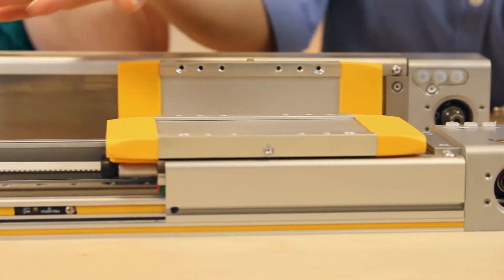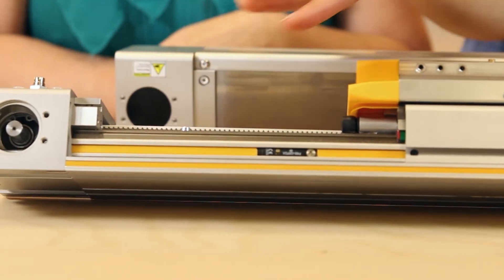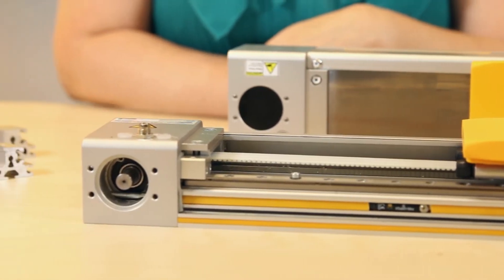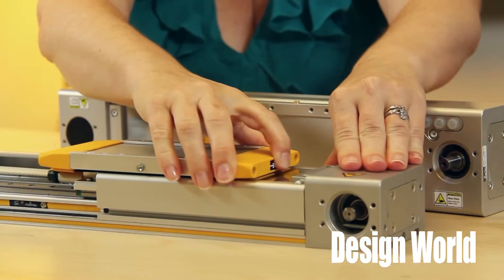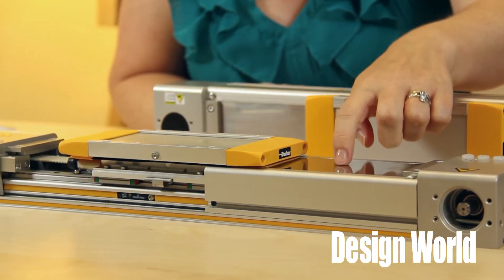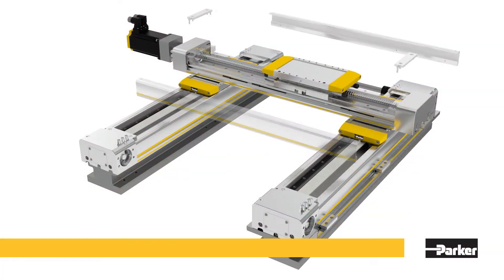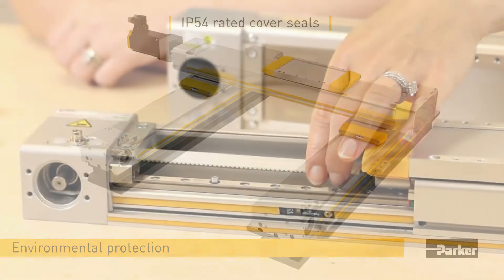Consider this HMR. It's a dual-square rail-guided actuator with solid covers that completely wrap the outside of the chassis, with Parker's best-in-class seal strip technology to protect internal components from contamination. But this HMR actuator comes in a multitude of other configurable options. For example, the HMR can be configured with or without the IP54 protective covers.